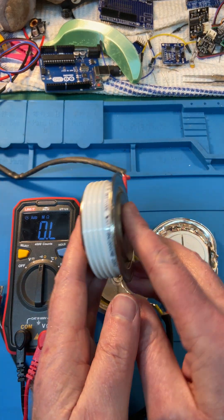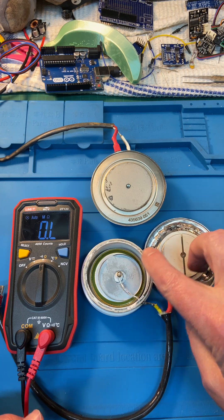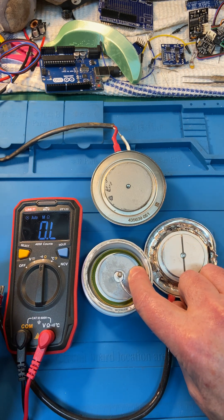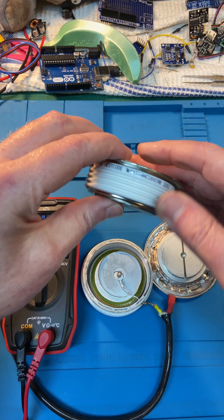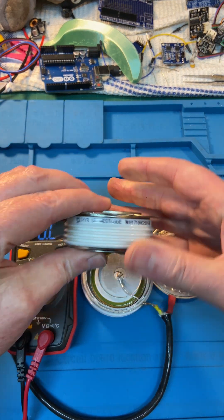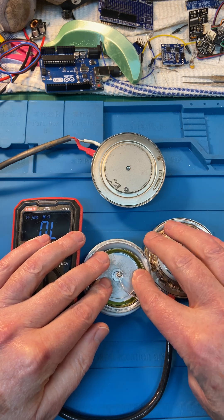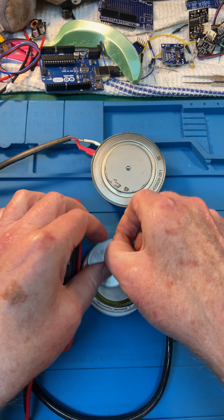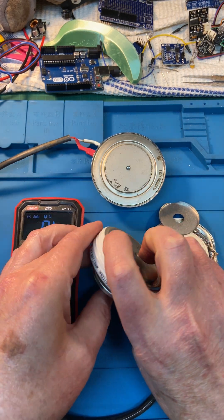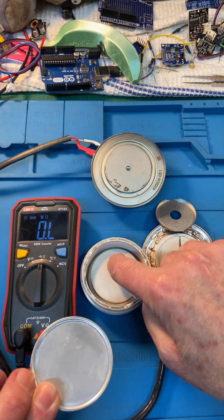Furthermore, these surfaces are flat, so once you put this in the heat sink and clamp it, that's what makes the contact inside. They're not actually mechanically bonded — it's a clamping force in between the heat sinks that provides the pressure and the electrical connection between the anode, cathode, and gate.